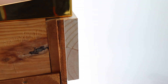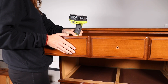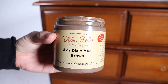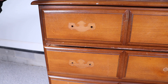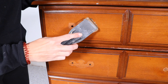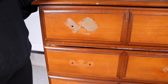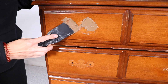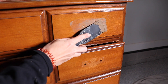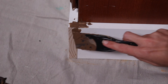I'm going to wait to affix the feet until after I paint so I don't have to cover them up. Now that the structural work is done, I'm starting prep — removing all the hardware and using Dixie Mud to fill the holes, since I have different ideas for new hardware. Dixie Mud acts like a wood filler; you can also use it for raised stencils. It does shrink when it dries, so you need to overfill your holes.